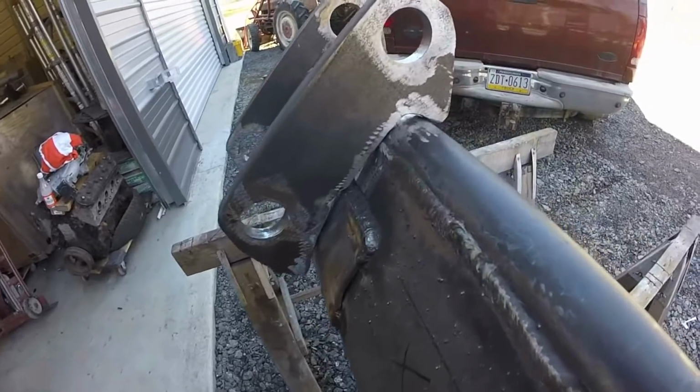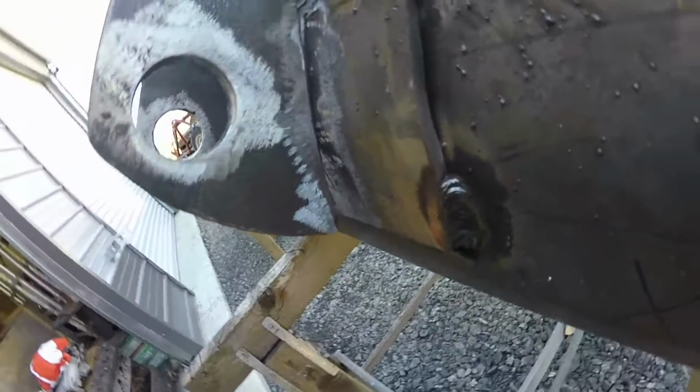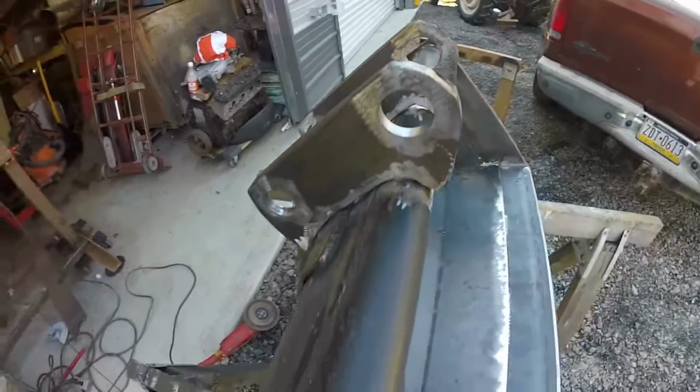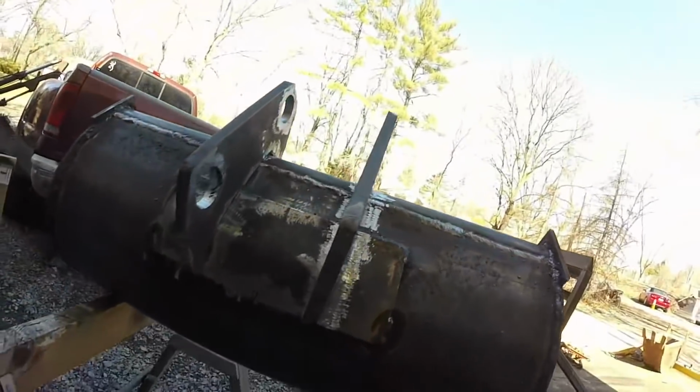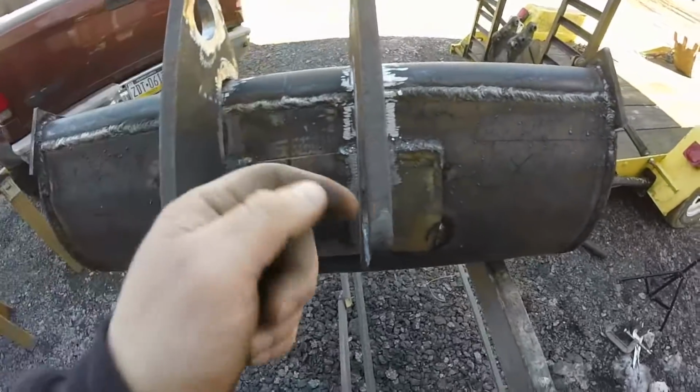So I got everything beveled. I got nice big gaps, which I'm okay with, because I'll just fill them in with weld on both sides and it'll be nice and strong. I'm going to tack the outsides,